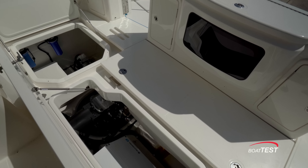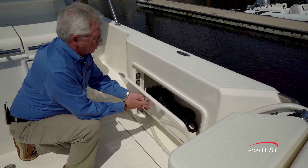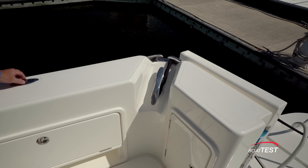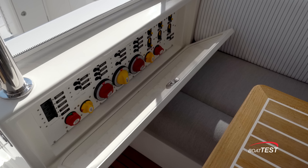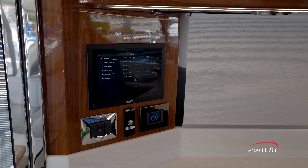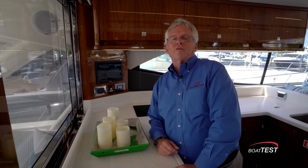There's additional mechanical access in the cockpit. There's a 50-amp shore cord on an electric reel with the control just inside the compartment. Cleats are recessed into the bulwarks with chafing gear just above, and there are even pull-up fender cleats. Behind the mezzanine seating is the main breaker panel and the battery switches. Just inside the door to the galley, we have the C-Zone control panel, which gives us electrical switching for all of the boat as well as tank monitoring. In addition to this monitoring system, we also have full-boat monitoring thanks to the Siren Marine system, which is installed standard on every Riviera.